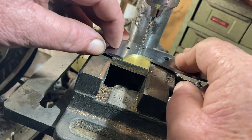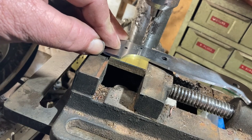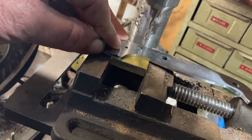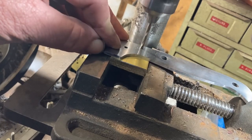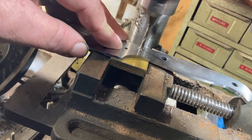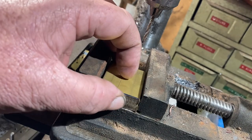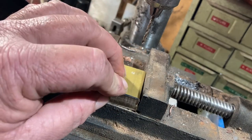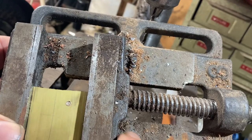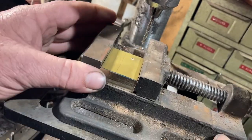I need to make sure we're lined up so we can cut the bevel on the front and still be clear of the pins. Once we've got the first hole started, I put the second piece underneath, get it sitting down tight to the vice so the hole is sitting off this channel, and I can drill through both of them with no stress.